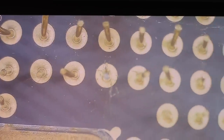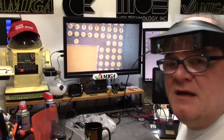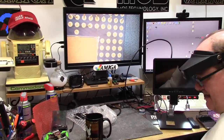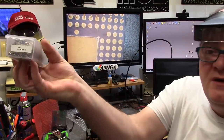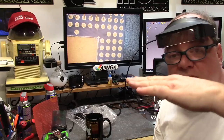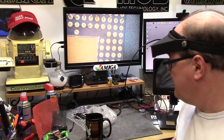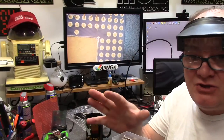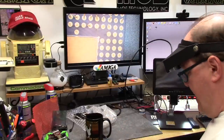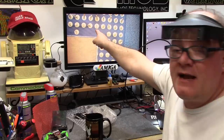All right, there in the center of your screen. Soldered on, and they're as crooked as a politician, the rest of them. But we're going to do our best to get them straightened out. How are you going to do that? In my box of pin headers, I have the female kind. I'm going to lay a bead over top of them and get them all lined up, and basically make a socket out of these so they're all straight and I can manipulate rows and bits as I need to. I need to get that pin back on.